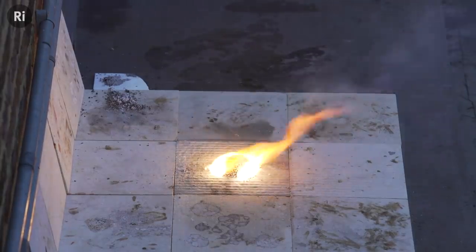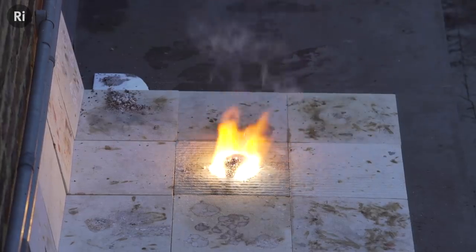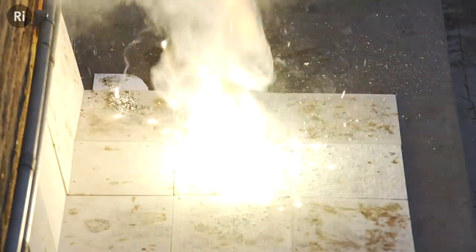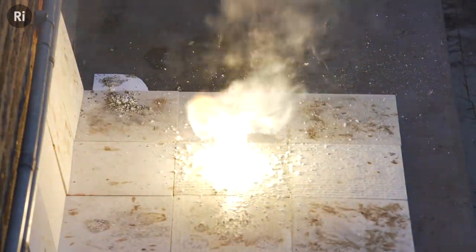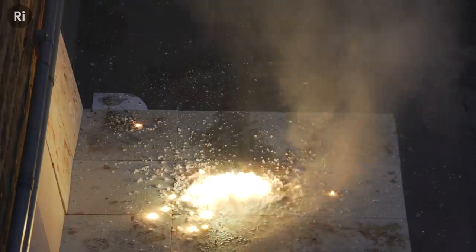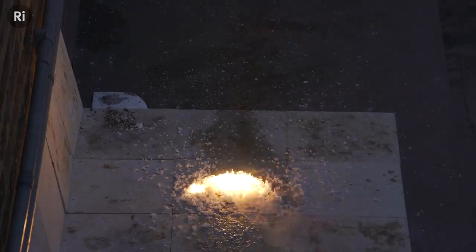The case with water is the same thing happening. The reason using water is even worse is that water can boil explosively, taking bits of fuel with it and spreading it around. And the other thing is, when you strip oxygen away from H₂O — from water — you're just left with hydrogen, and hydrogen gas is also explosive. So don't use carbon dioxide or water on a metal fire. It's a class D fire, so you have to use powder, which basically means you drop a solid mass over the fire and that smothers it.